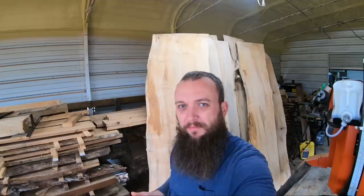I can re-grind these blades, no problem, but in my opinion they are never as sharp as when they're ground for the first time. If I use a blade four or five times and never hit metal, just re-grinding to the profile each time, it's going to be a lot sharper than if you hit metal with it. You lose so much material when the tip breaks off - that's probably about three or four grinding trips worth of material removed right there. You might get two sharpenings out of it before it's pretty much gone.